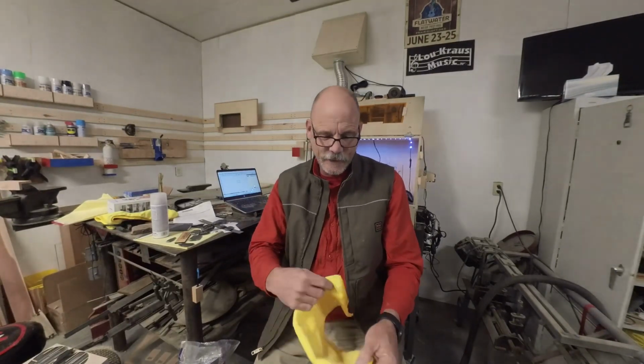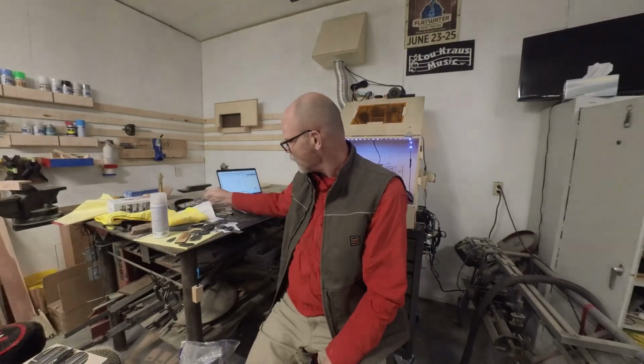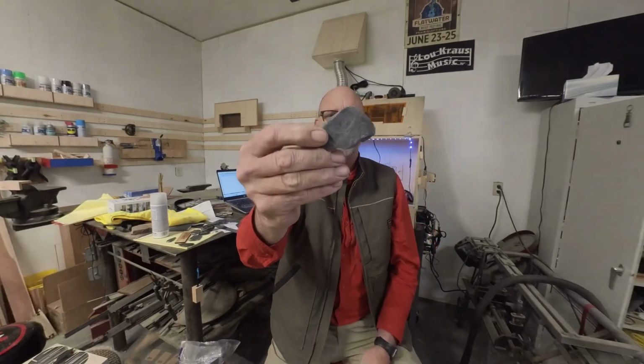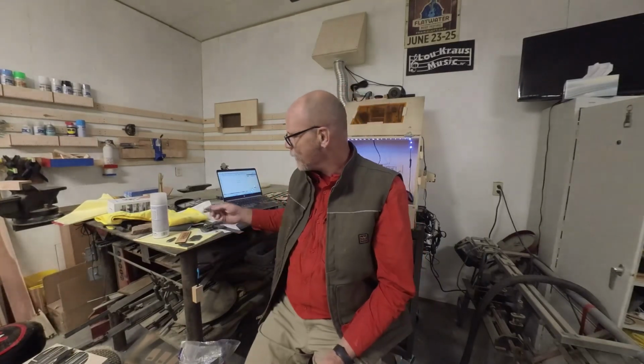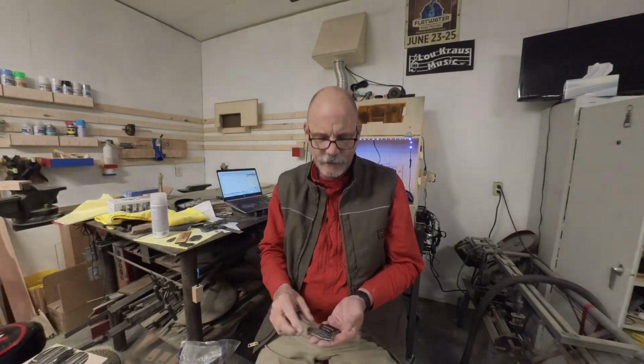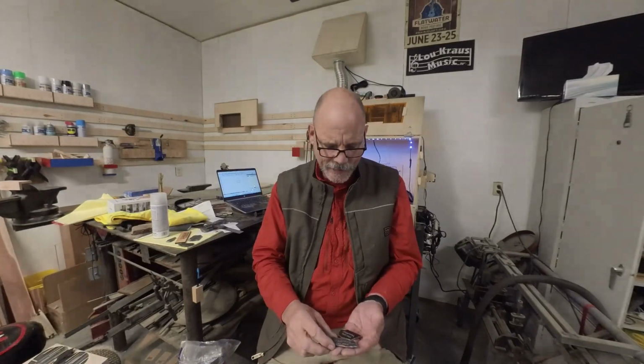Slate, one of the reasons that it laser engraves well is because it's a fairly soft stone. But once you clean them up, I take them under the sink, and just with a brush, you end up with a nice little piece of slate. Now, there are irregularities on here, so you're not going to be doing fine images or a photo on there. But what you can do are things like this, where you've got just some lettering. They're really quick to do. I'm using a 20-watt Xtool D1 Pro, and my settings on there, I do 50 millimeters a second at 30% power, and do little text. So they're pretty quick to whip out.